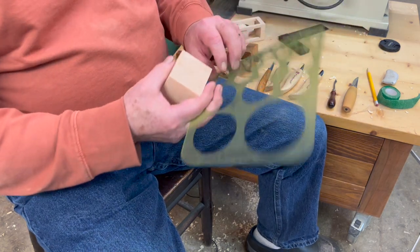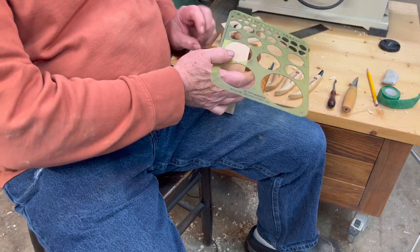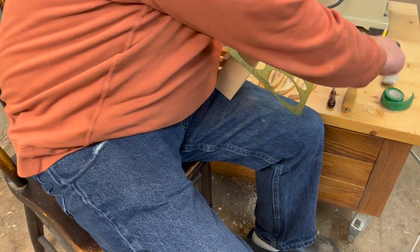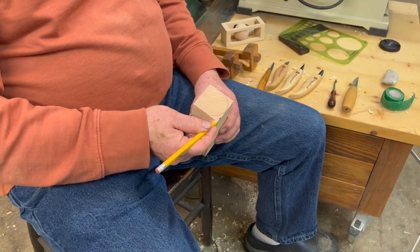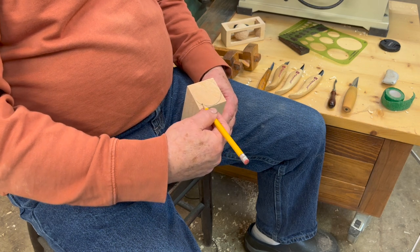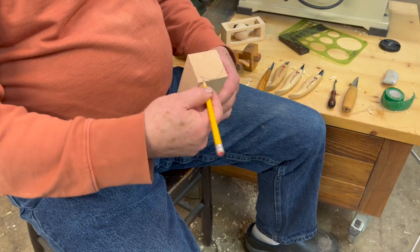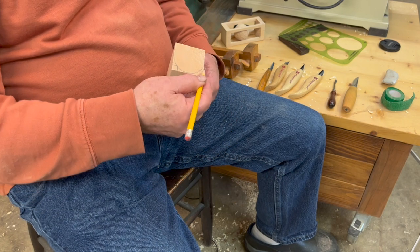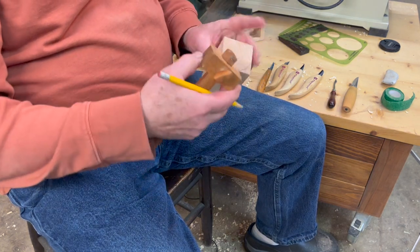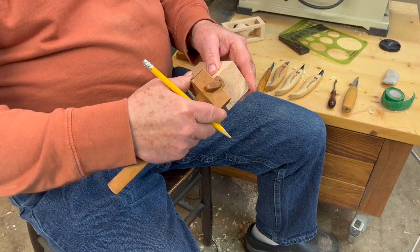This is helpful too — this is a circle template. And because it's two inches in diameter, I'm going two inches here with my pencil. This is how I determine how thick those posts are going to be. I'm just touching the corner of the circle, and that's what I set my first marking gauge to. So, set it there — that's it.